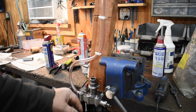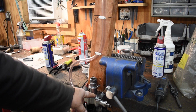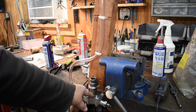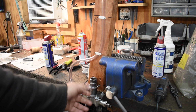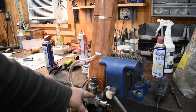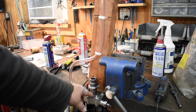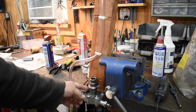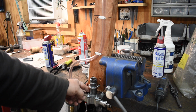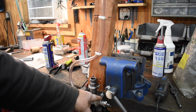In the third iteration of the test, I had my oil seal installed in the bottom of the cover over here with a retainer, because the seal easily came out and I didn't want it popping out while the engine was running. So there's now an aluminum retainer pressed in here with Loctite 518 to retain the seal. This was still good, bone dry, no oil coming up at all. This still leaked, although not as badly.